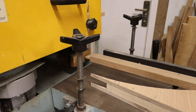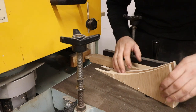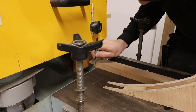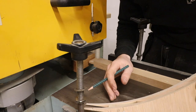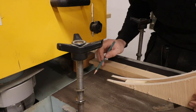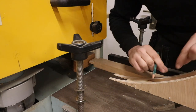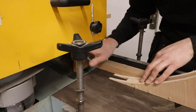I have planned to do the frame with a domino joint. I thought it'd be good practice for the doors to do the frame with a scribe as well. The tenoner is set up so on that shoulder point there, the face is the perfect height. So I've set up this little jig to hold the curved pieces or the curve rails, so that the spring point of the curve when it exits this jig, it's flush with this bed here. So if you put the curve on and put it true to this piece, it will just touch the bed when it's clamped to that and then start to rise off.